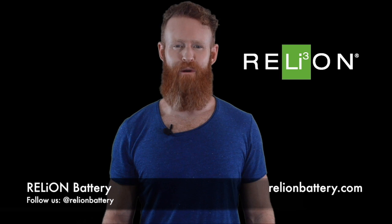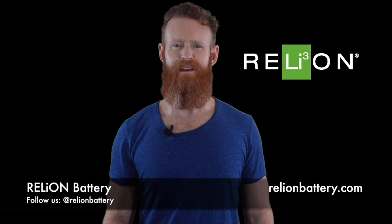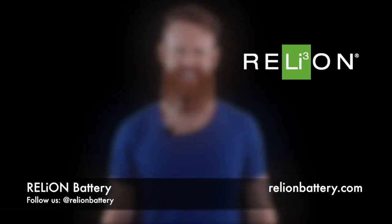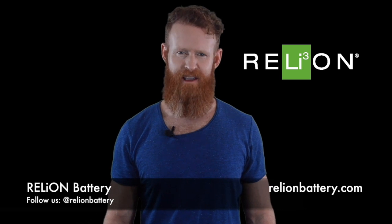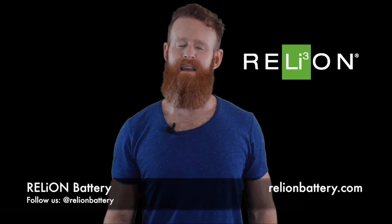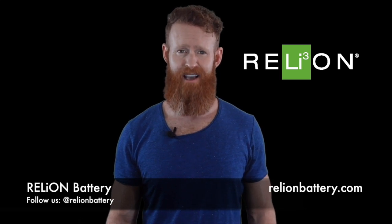The cells of a LiFePO4 battery operate safely over a range of voltages, typically from 2 volts to 4.2 volts. Some lithium chemistries result in cells that are highly sensitive to over voltage, but LiFePO4 cells are more tolerant. Still, significant over voltage for a prolonged period during charging can cause plating of metallic lithium on the battery's anode, which permanently degrades performance. The cathode material may also oxidize, becoming less stable and producing carbon dioxide, which may lead to a buildup of pressure in the cell.